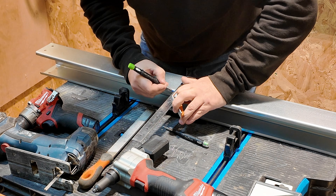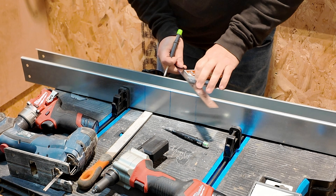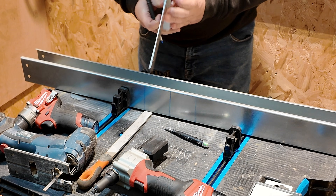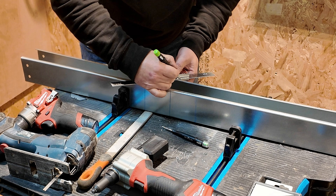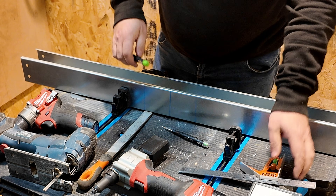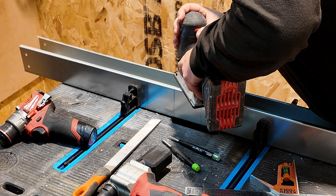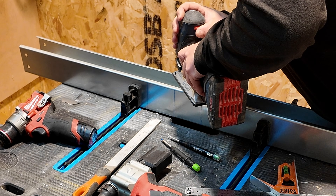You can see here we've got our line all the way across, and this is where I need to transfer that mark to the front lip. Then I make my 45-degree marks off that to put a little cut in that lip, so when the angle's formed we get a nice neat join. That'll make more sense as we move further through this video when you see the join coming together. So that's all the marks we need to make and now we can start making some of the cuts along those lines.